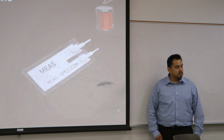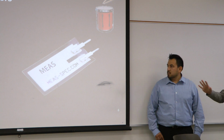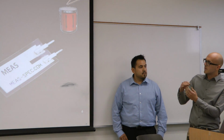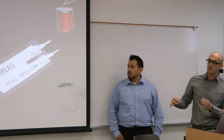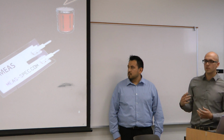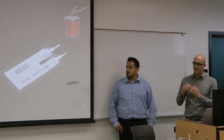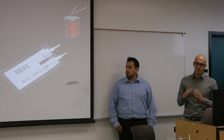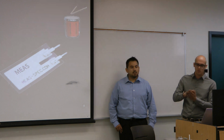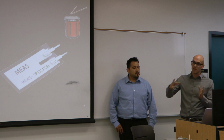Alright, so these are the vibration sensors. We connect these, there are 2 leads, one positive, one negative. This is a piezo material, so when there's a vibration, when it starts moving, it creates a voltage across those 2 leads. We're connecting one side to an analog pin and the other to ground, and it's a 10-bit value, I believe, so it's 0 to 1023. We use that value later to detect a hit. If you're not hitting it, it shouldn't be moving, so the value should be pretty low, underneath like 20. It's creating voltage, but then it's being converted into a digital value.